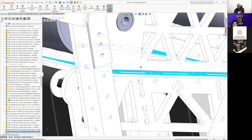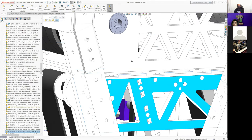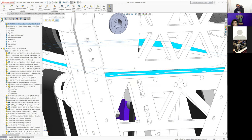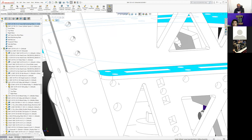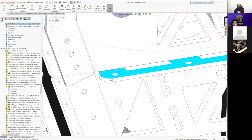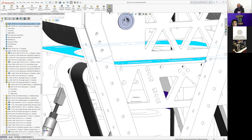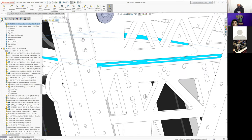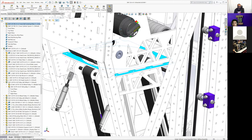And this was able to be installed even when these plates are on. There's a gap cut into this so the plate can be inserted from the side and pressed down. Instead of having a slot for a nut and a bolt, because we wouldn't be able to put a bolt in from the top here as there's no room, we just had zip ties go around it and secure it into place. That worked more than well enough for this plate, right? It's not super load bearing. It only has to cap it. So using the zip ties allowed us to do that without the bolt assemblies.